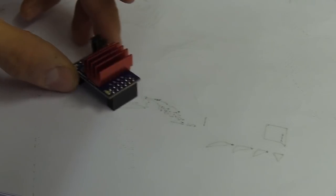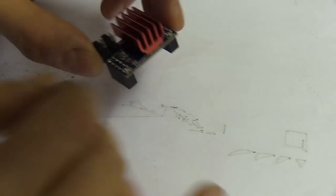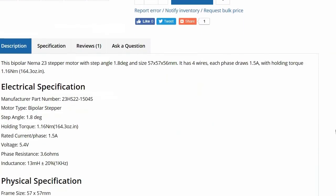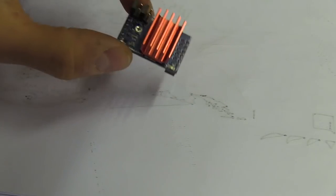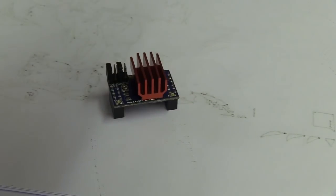I'm planning to use 1/16th steps on my BSD109A Bigfoot drivers, which you set with the jumpers on the drivers themselves. I'll be using them with NEMA 23 1.16Nm 1.5A 4-wire stepper motors from OMC Stepper Online. To make these work I'll need to set the voltage reference by adjusting the trim pot on the individual drivers. The VREF can be worked out by dividing the current limit by 2 — in my case 1.5A divided by 2 is 0.75V. This can be measured on the driver with a voltmeter by holding the positive lead to the crown of the trim pot or another voltage jumper pin, and placing the ground lead to any ground pin on the controller.